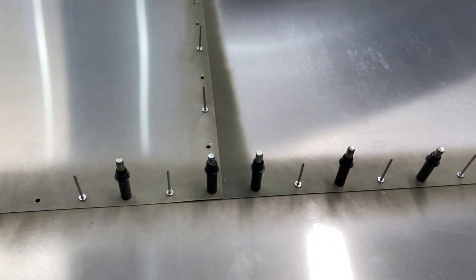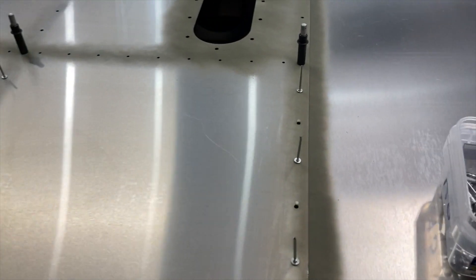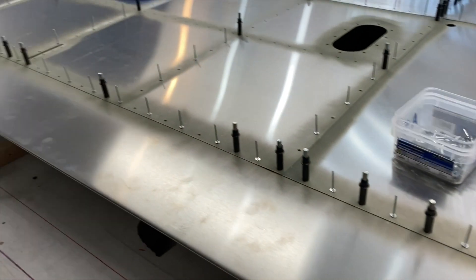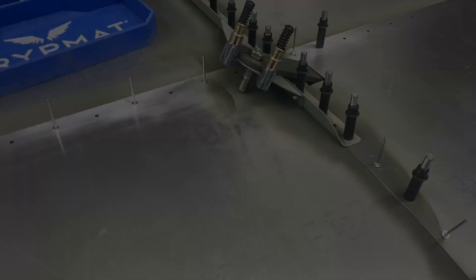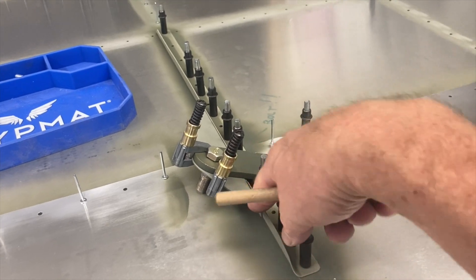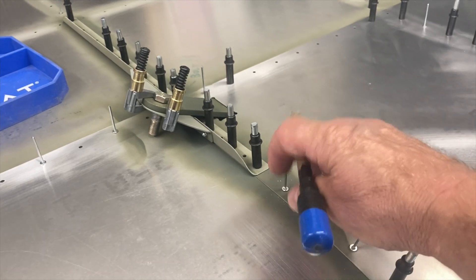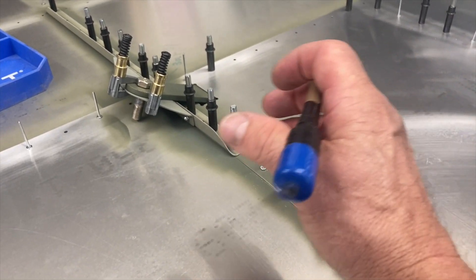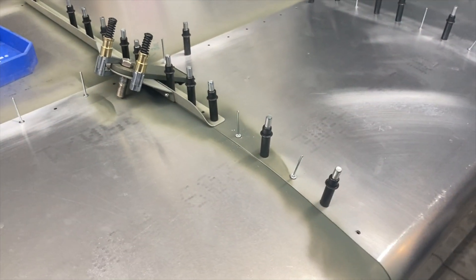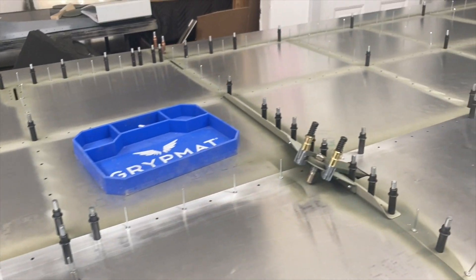Look at that - one-handed, like a pro! Well, we know better than that, don't we. Give it a try. I put this in first to help line it up because it's such an important piece, and worked out from it. I had to un-cleco to get these in because it just holds everything so nice and tight when you've got your clecos in. Those A5s like to catch on the edge of the piece in the back.